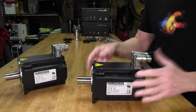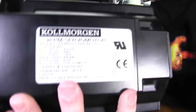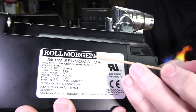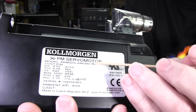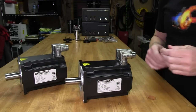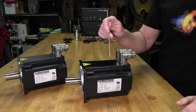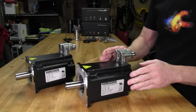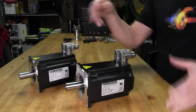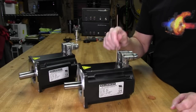The new Version 2 motor — in my case a refurbished unit — has a different model number. Instead of 'EJ' it shows a 'C', which means the feedback device is a resolver, specifically called a Smart Feedback Device or SFD. So the Version 2 motor uses a resolver rather than an encoder, which is the key change. Interestingly, within the same manufacturer, the encoder is rated in PPR while the resolver is rated in CPR.